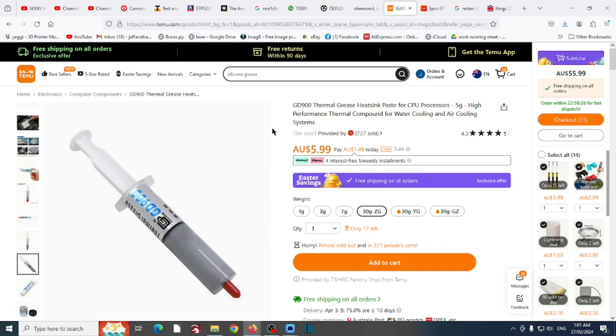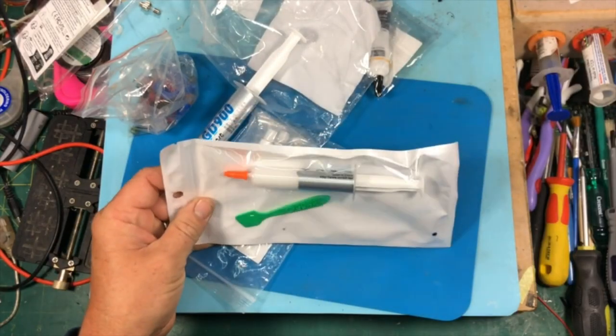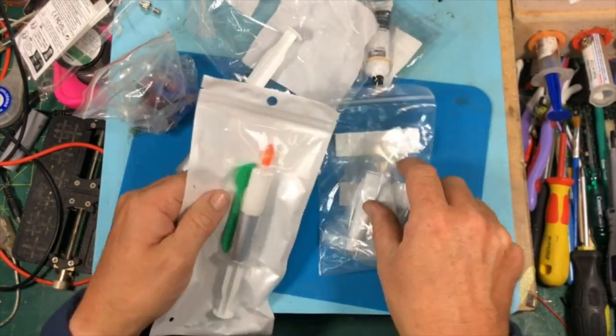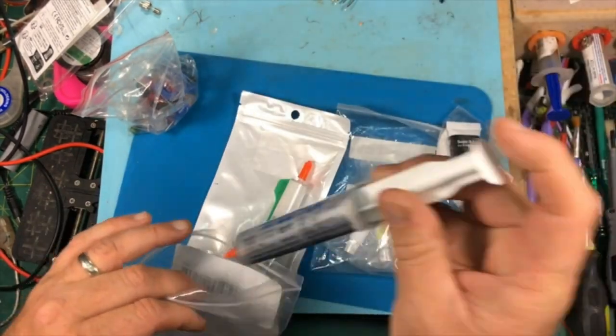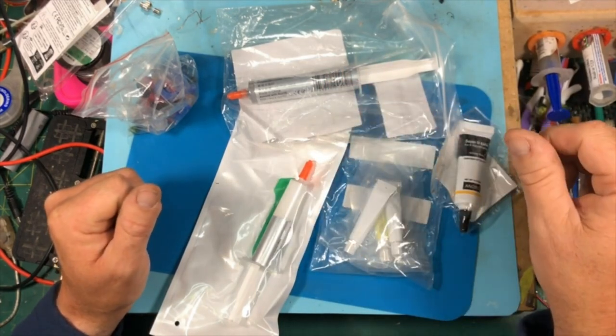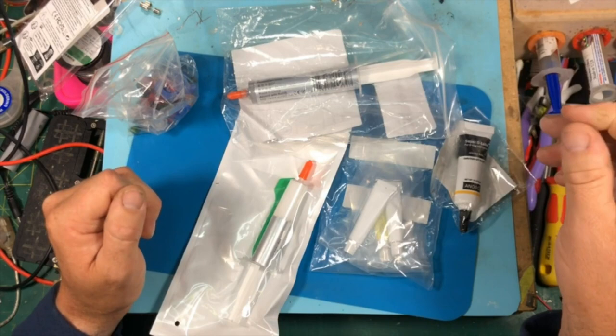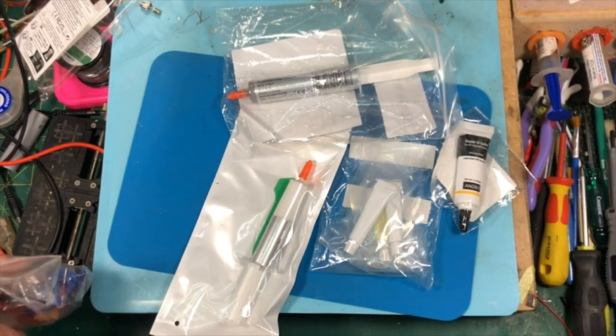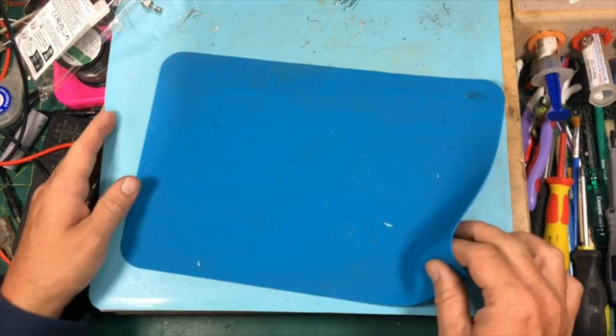This one's in grey — I don't know that it makes much difference in colour, the other one's white, and it comes with a little scraper. That one was $2.89 for a three-pack, and $1.90 for the one with the scraper. Just a few greases and heat compounds — when you're putting MOSFETs and those sorts of things back inside stereos, or doing PlayStations, you need to replace the thermal paste whenever you open them up.